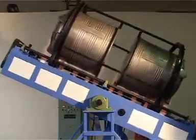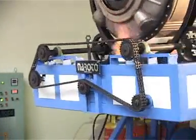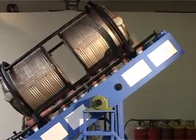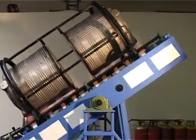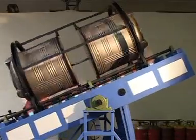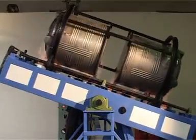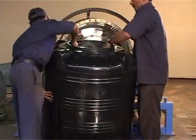This movement is called major axis movement. By this drive, the main frame tilts about 45 degrees both left and right side, allowing the polymer powder to move and spread evenly across both the bottom and top of the molds, and the sides of the molds.